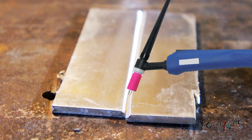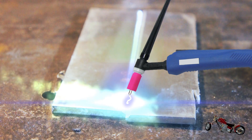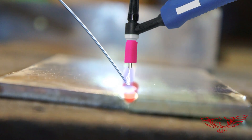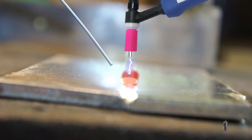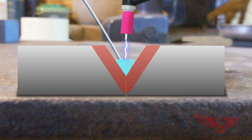Here's how it works. The electrode is charged with enough voltage to create an arc with the part and enough amperage to create the heat necessary to melt the parts that need to be welded together. Once you have created a little pool of melted metal, we can start adding the metal filler to fill up the space between the two parts and strengthen the joint. You do need to get into the right rhythm though — you add the filler and then spread it with the torch. If you get it right, you'll get the sought-after stacked coin look typical of this welding technique. To join two thicker pieces it's ideal to bevel the edges to form a v-shaped gap and ensure deep penetration of the weld. If needed, more passes can be overlapped to achieve full filling of the gap.